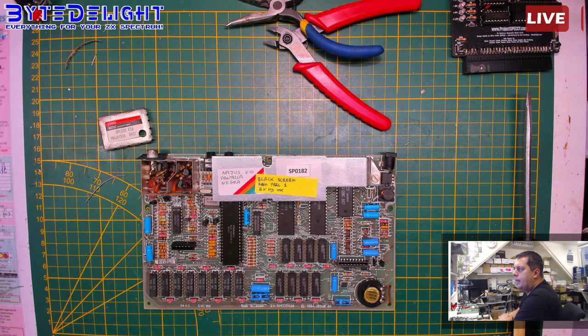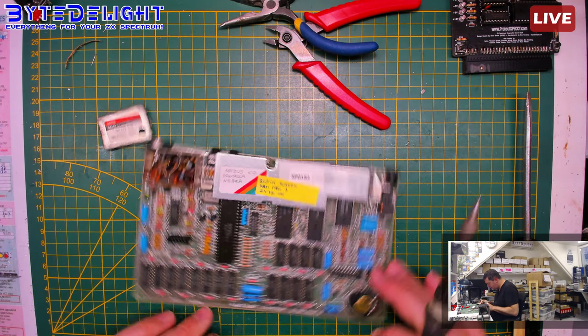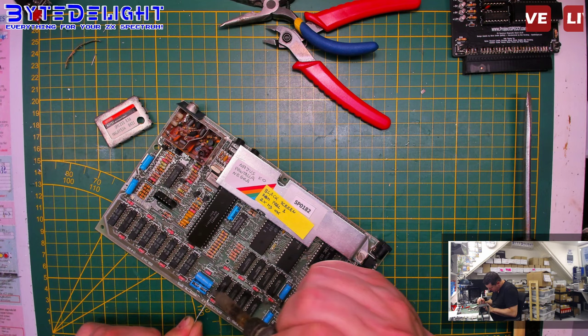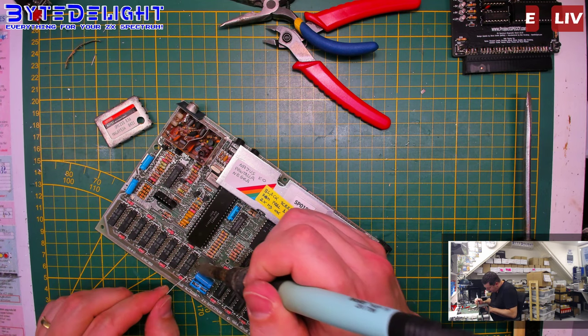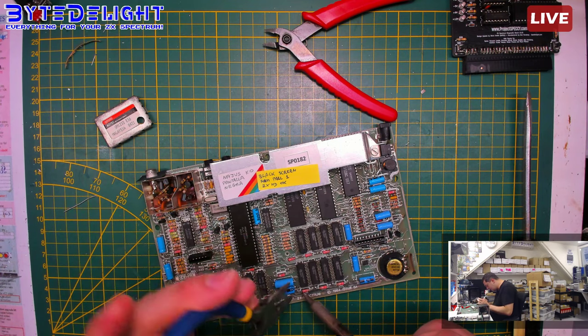let's check the schematic. Yeah, I think so. I think the 100 microfarad is the main one for the 12 volts. But we've got a couple more. We could also do the 1 microfarad C46. So let's do a couple. Not all, because we just want to get the board working, so for now. And I do think one of the lower RAM chips is failing, so we need to replace one, but I just want to make sure it's not the capacitors.